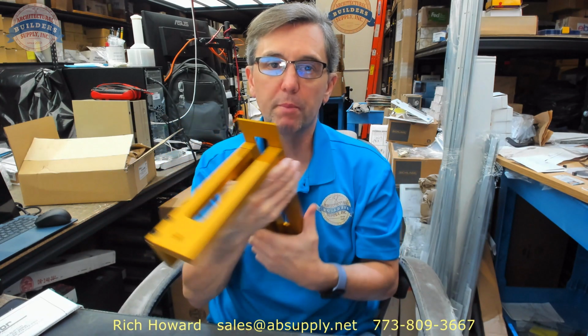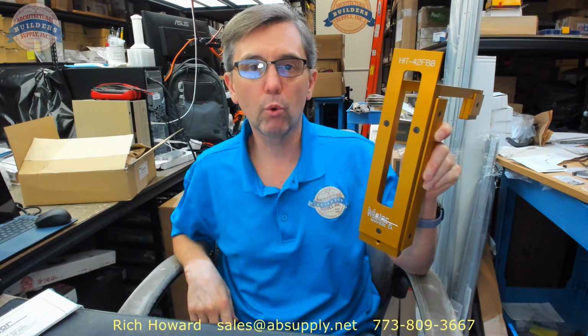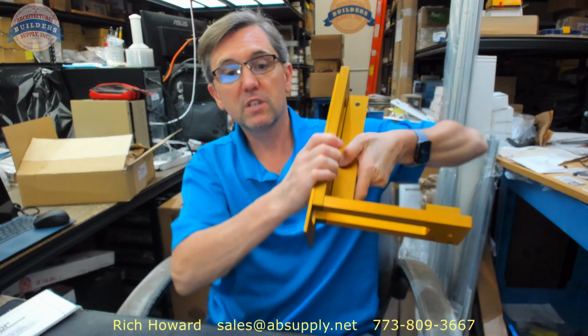What are you going to use it for, basically, is the question. Well, you need to install those flush bolts, and doing flush bolt work, corner flush bolts like these are corner style flush bolts. They go in the top or bottom corner of the door. They're easy compared to extension flush bolts. If you're doing extension flush bolts in a wood door, I encourage you to not try to do that in the field unless you've done it, or unless you've got the tools, or unless you're brave enough. Don't try it. It takes experience and ruining some doors to learn how to do it right. Lever extension flush bolts are really meant for metal doors, not for wood doors.